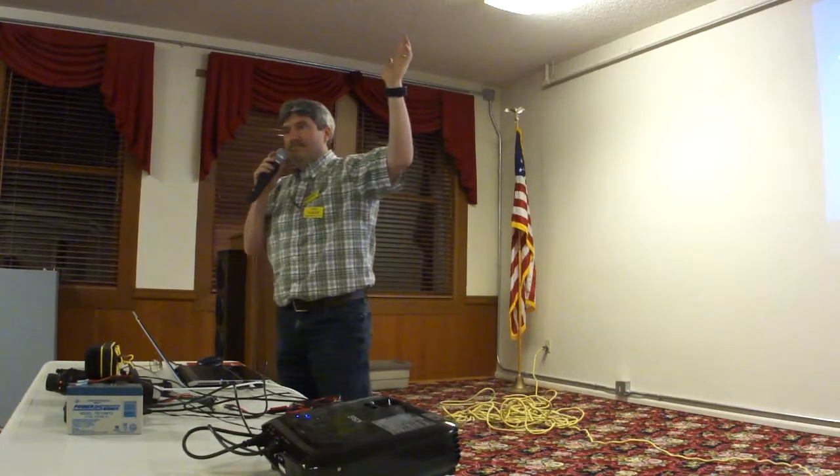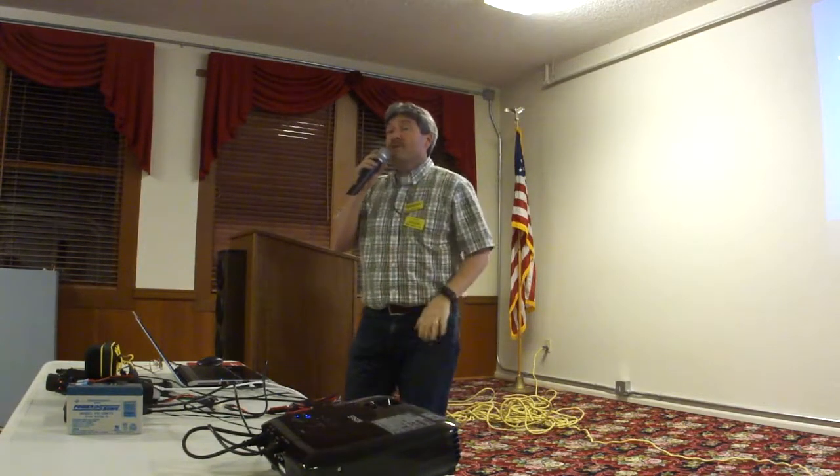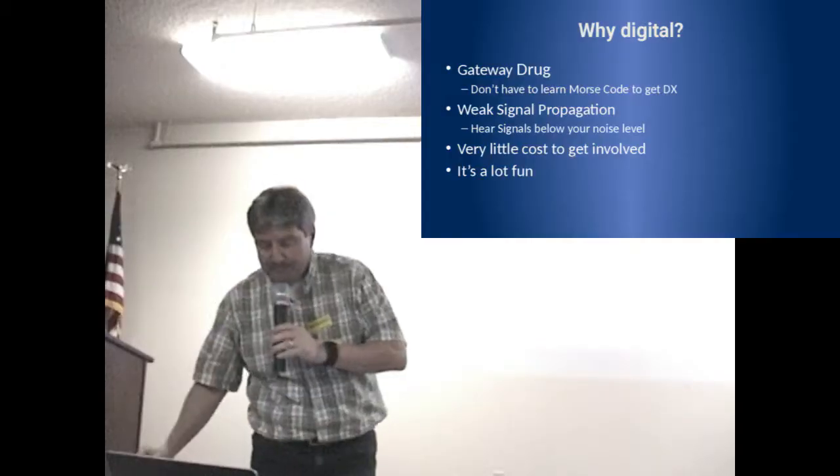Anybody got any ideas on how many dB we can go below noise and pick up a signal? Any ideas? 30. 20. Keep going. 30. Usually 45 dB roughly. I'm not an expert. There might be a mode out there that goes 45, but I'm thinking 36 with JT65. So you can go 36 dB below the noise level and hear a JT65 signal.